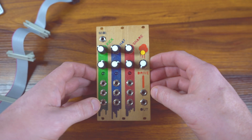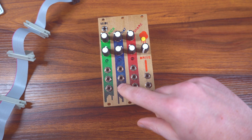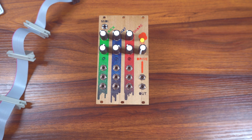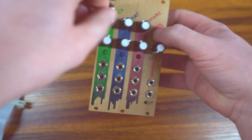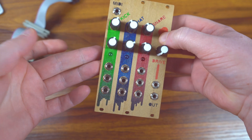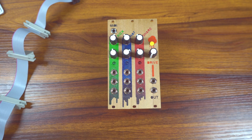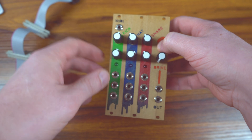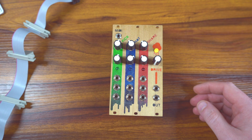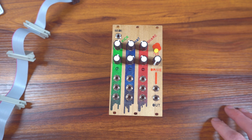This button was an afterthought I'd just recently put on. I noticed when I was doing the gate inputs that if you have MIDI, there's velocity control over the volumes, but if you're just using gates, the sounds were kind of not balanced well volume-wise. So I popped this button on so when you hold it, this top row becomes volume control for the voice. And in doing that I thought I should maybe do something with these, so I ended up adding three samples — a kick, a hat, and a snare sample. When you hold this down, that controls the volume of the sample. The sample doesn't get any pitch modification or decay time, it doesn't go through an envelope or anything, but it does go through the distortion. So you can control the volumes independently and mix them together.